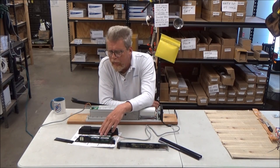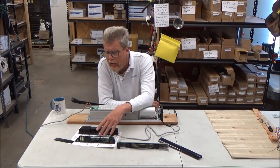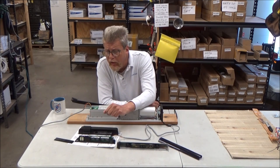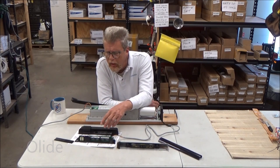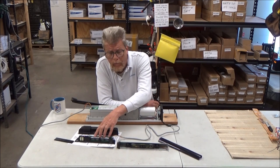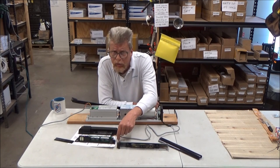That safety function could be done with the 227L as well, but the benefit of the M235 is it's a little more sensitive, especially on that safety. Whether you want the PIR or the microwave to be the trigger depends on how you wire it into our 120 series. One thing I noticed: we've got glass lenses on the PIR, same as with the 227L.